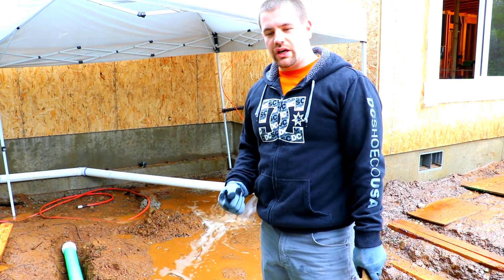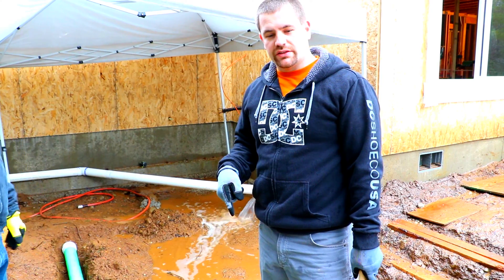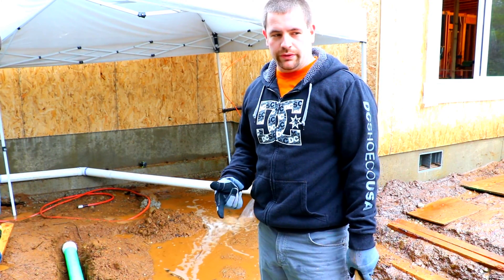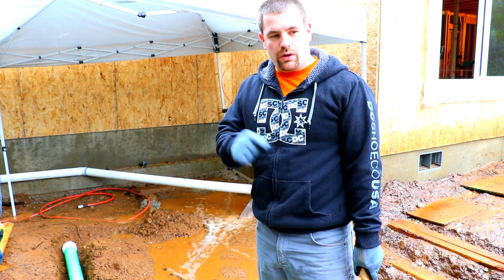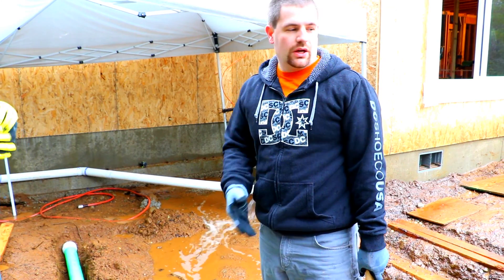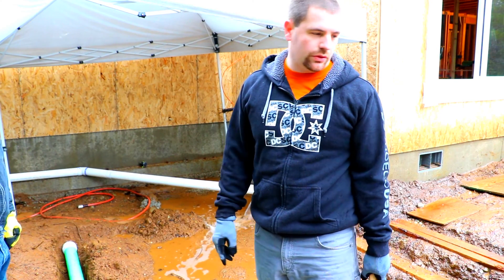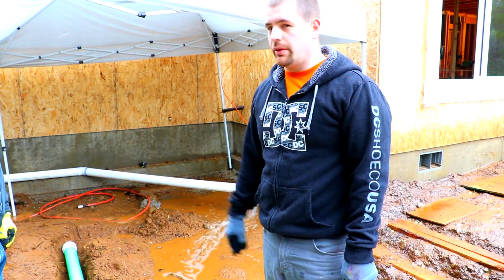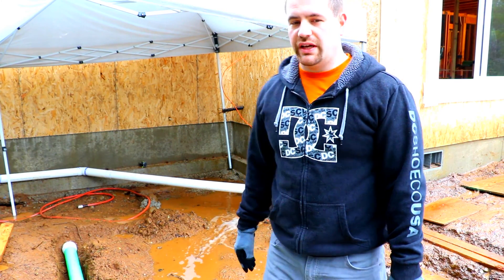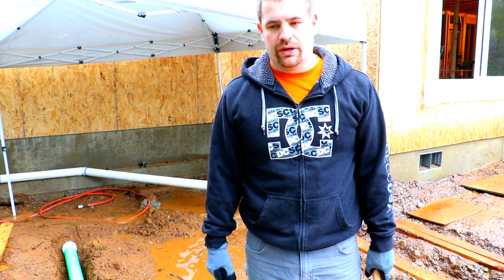Other things to note: when setting tanks in the hole, these massive 11,000-pound cement tanks can actually float. What we're currently doing is adding water into the pump tank because it's slightly lower than the septic tank and will fill up. As long as you have enough water above the puddle in your septic hole — currently about a quarter of the way up the tank wall — your tank won't float. If the tanks float after the pipes are attached, they'll move out of position and possibly break the pipes.